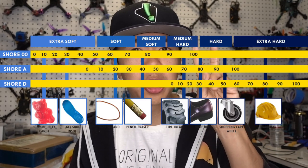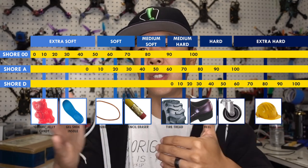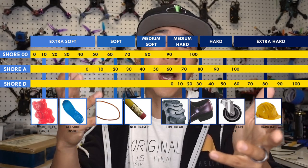And then while we were doing that, we were like, okay, great. Since we were in the process of making it, we also started playing with the polyurethane mixture ratio. And so when you put more of one compound than the other, it makes it harder. And in the world of this stuff, the way that you measure how stiff or soft something is is called the durometer or Shore hardness. And there's a value that tells you how squishy or stiff or soft something is. And so the other thing that we found was that the squishier or softer it is, the stickier it got.